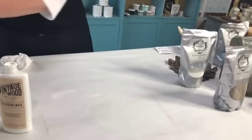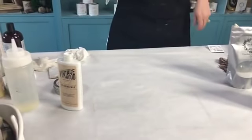Does wax have to be maintained? Generally no. If there's a lot of wear and tear you can come back, but as a rule you put it on and leave it. Maybe once every six months to a year on an antique piece. I use furniture tonic and regular wax on my furniture — I never use Pledge or Endust because they're dust magnets. I want to give my furniture actual food. Just one coat of wax is good to go.